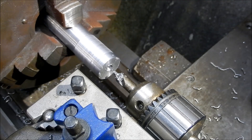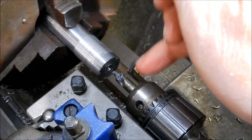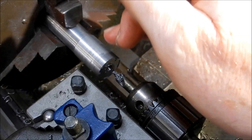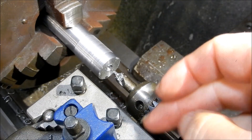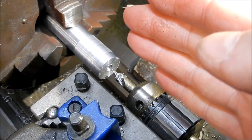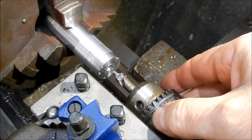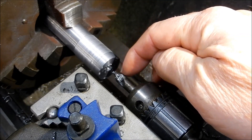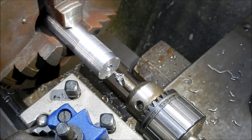That's got the center fairly well. If the shafts were too far bent we would straighten them out as best we could; if they were too far out to use this technique we had to go in with a little D-bit off the tool post and just remachine those centers again. But if they're just a little ways out, it's a very handy little trick — just use the tool post with the saddle coming across, apply a little bit of side pressure. What will happen is it will try and follow the offset center and wobble around all over the place, so just apply a little bit of side pressure, and make sure the cutting edge is horizontal.